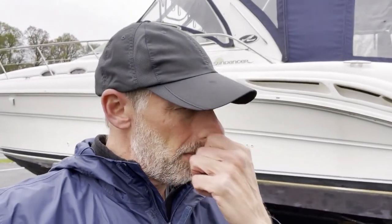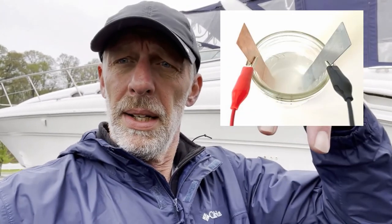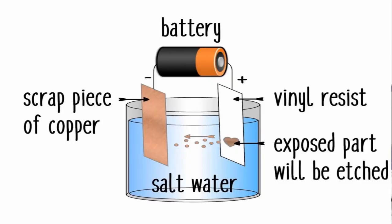I don't know if you remember from science class — there was an experiment where you took two little pieces of different kinds of metal, probably copper and tin, stuck them in a cup full of saltwater, and that made a simple battery. Well, when you put a boat in the water you get the same situation — you become a battery. One piece of metal gets deteriorated, pitted, because the electrons are getting sucked out of it.